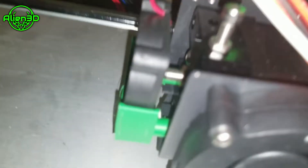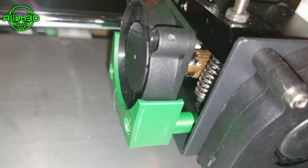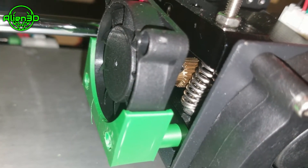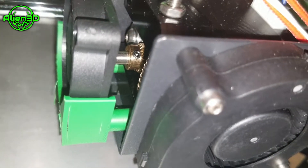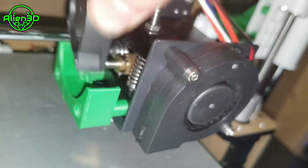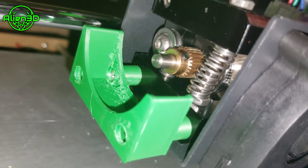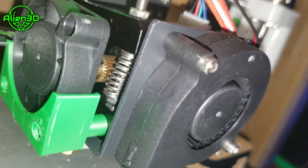Another upgrade: as long as your fan is blowing directly into the extruder, you don't need the heat sink. Basically this fan is to cool off the heat break to keep your filament from getting too hot and causing jams. With this fan holder, when you want to feed your filament, you can just take the fan off, feed your filament, get the gears right, and this allows your fan to slide in and out and still blow directly onto your extruder.